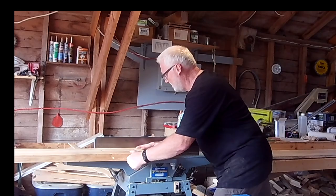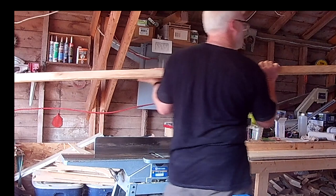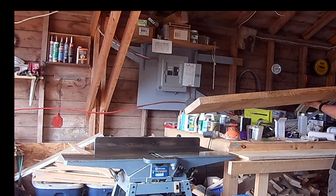With the 4 foot measuring 9 inches in thickness, that means 6 layers of 1.5 inch laminated timbers were needed, and being nearly 16 feet in length, each layer was made up of timbers from 3 to 12 feet.